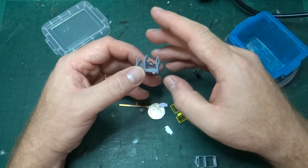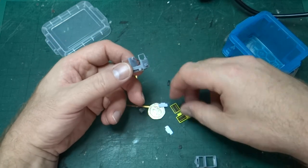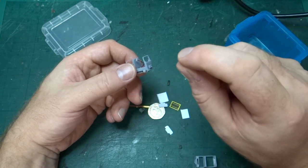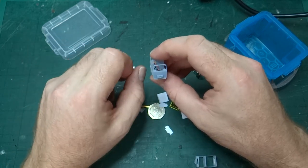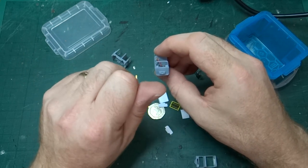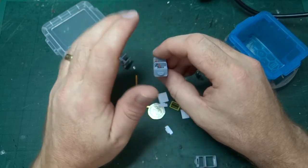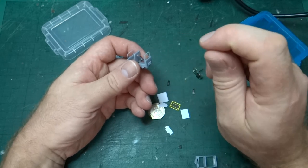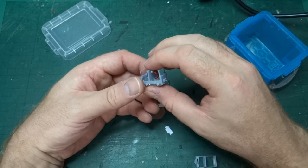Obviously, I might have to increase the size of the wires and do fewer holes, which I possibly could do on an etch, but having had problems with tiny etches and etching all the way through on weird shapes for the Hudson-Hunslet, the maker's plate at the top was a pain. We actually ended up doing half etching with the intention that you'd flood it with black paint to make it look like it was all the way through. So I'm wondering whether I can do something similar, either etched and just half etched through where the holes are, which might hold it together. I might even be able to print that.